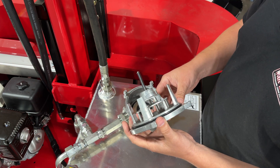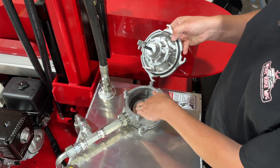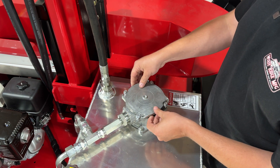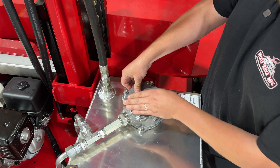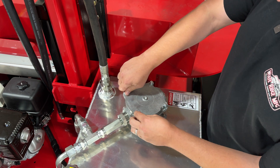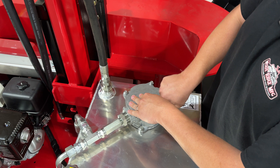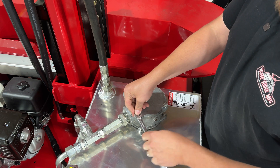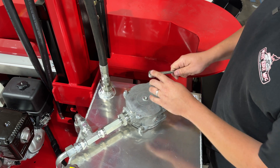Take a look and make sure that your o-ring looks good here as well — this part will actually seat into the oil filter. So we'll gently put this back in. Since I did not take the bolts all the way off, we'll press this down. You can actually feel the o-ring starting to seat. We'll twist it back into position and then snug these up finger tight, then go across from each other — not in a circle. Make an X pattern.